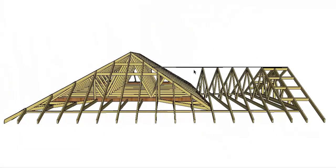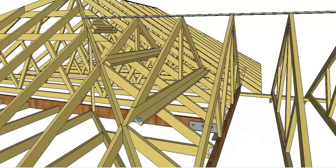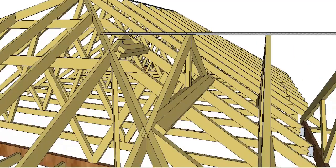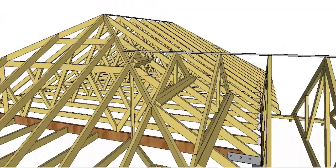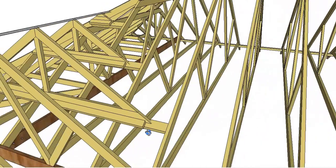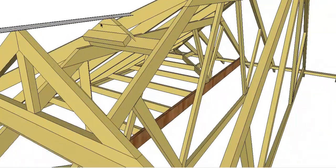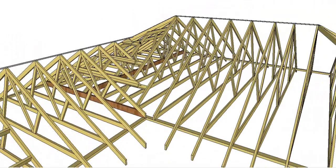Except for this section, that's most of my trusses in — just have to fill in this gap here, and this is going to be our saddles. Saddles can be a bit tricky. They need to be supported on the roof, and generally we just nail a batten in between or onto the actual rafters, and that lets the saddle sit on that. You have to make sure they line up with your existing roof — they should be your standard spacing apart. The last one normally gets a little bit tricky because it's normally very small, and if they have a large amount of overhang you may have to put a noggin or a trimmer underneath to support the end of the truss. You can see the saddles generally form where our valley will go.